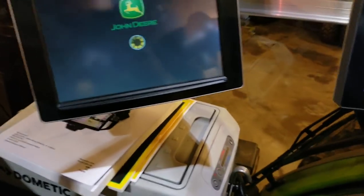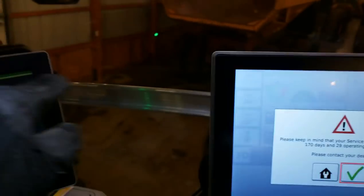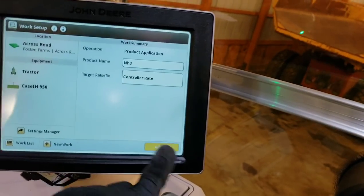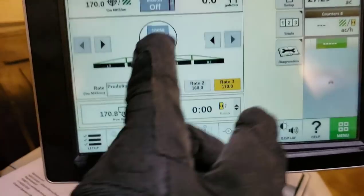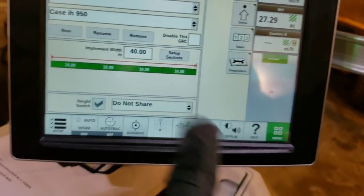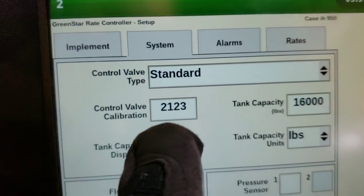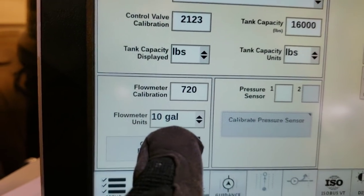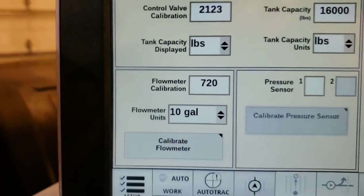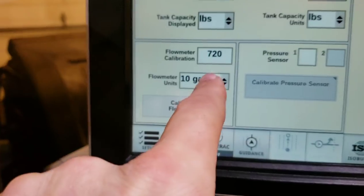There's all the wires, and it's trying to boot up. The display is sitting at an angle because the rail goes at an angle. There it goes - there's your run screen right now. What threw us off was under Setup > System you enter the calibration numbers for the flow meter, and it has to be set to gallons/10. The tag on the flow meter says 720, but that didn't mean anything obvious. If anybody is setting up a Green Star system, the book does not tell you that a 720 number means gallons/10 - you put in 72 but you've got to drop a zero.